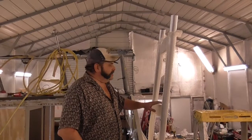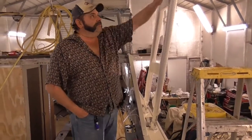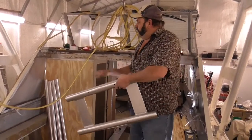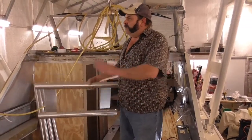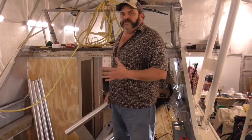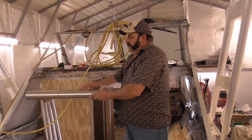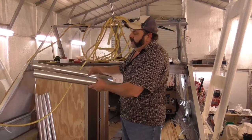We've left this loose but in place now — we've installed it on our mounts, this upper assembly vertical, and we're going to leave it loose for a reason. We've got to put the tubes in here across, and there are four tubes to this set plus a center section. This center section actually glides on these four tubes — it has O-rings that you put on the pipe, then you assemble this and slide it back and forth. The purpose of that is to adjust for beam width on a boat, since some boats are wider than others. The kit is a general size and you adjust it to the center line of the boat, then drill holes through the pipe and put long bolts through to lock it into place. The center section is where our radar array will sit — there's a tray that goes on top with four bolt holes.